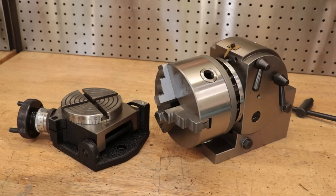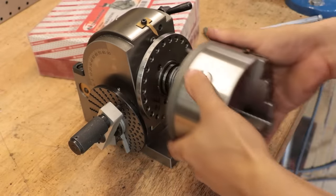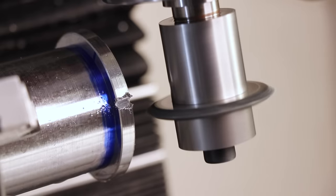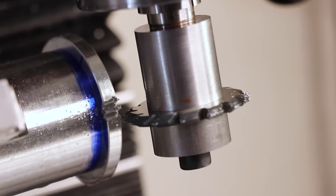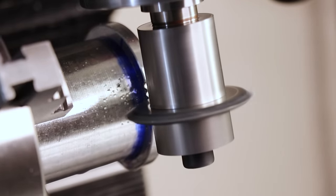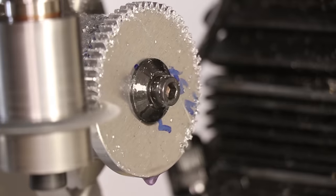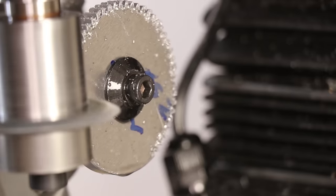The dividing head really works best with the parts all firmly locked in place. In the few times that I have tried to cut curves with the dividing head, I have experienced the chuck unscrewing and coming loose, and that has caused me to scrap parts and break end mills. I'm sure there are ways of getting around that, but I'd still be left with the clearance issues that I talked about earlier. The dividing head really for the most part is just best suited for indexing and gear cutting, which is really what I mostly use it for. I am aware that they do sell dividing plates for rotary tables, which further blurs the lines between what rotary tables and dividing heads are used for, but from what I've seen most of the plates that are sold are for 90 to 1 rotary tables, which this one isn't. Although I guess with a milling machine and DRO you can always make your own indexing plates if you really wanted to.